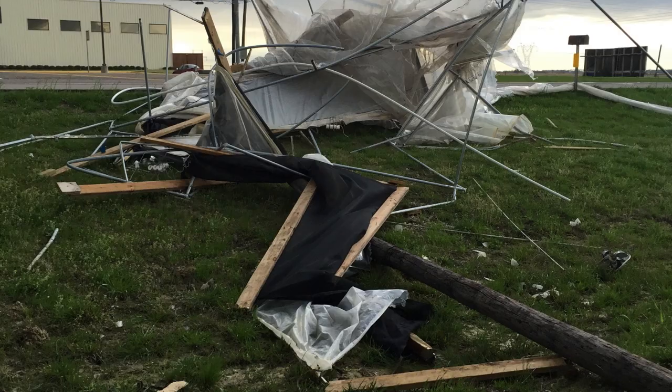The end wall keeps wind from getting up underneath the roof or the other end wall of your structure. Anytime we've seen a hoop house fail on social media, it's often because there's damage, a hole, or they haven't built an end wall at all — essentially building a big parasail that gets lifted by wind uplift. You're basically telling the wind it can't get in and cause damage, just like you wouldn't want a car without a windshield.